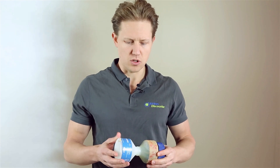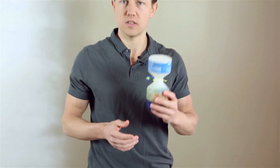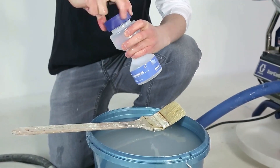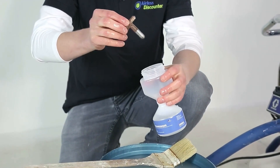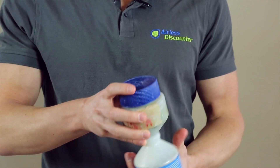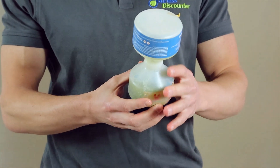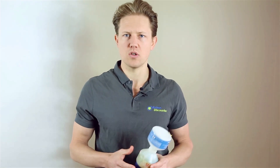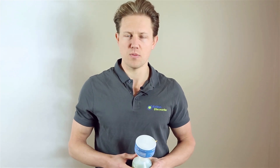After you're done spraying, make sure you clean the spray tip and the spray tip housing. You can take the spray tips and use one of these hourglass containers — place your spray tips at the top, seal the container, and turn it around to let the liquid run down. This is how you can store your spray tips until you're ready to use them for another job. Thank you so much for watching and I'll see you in the next video.